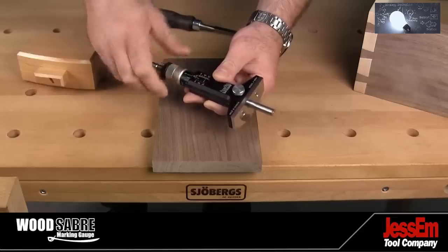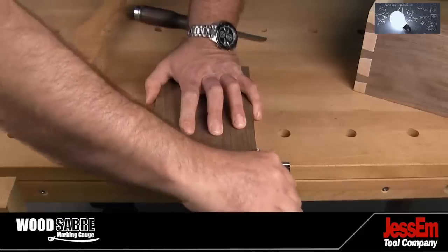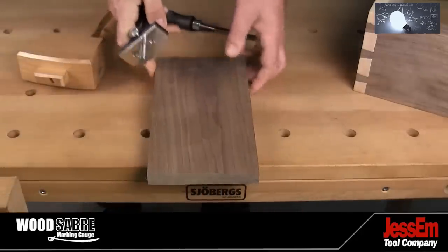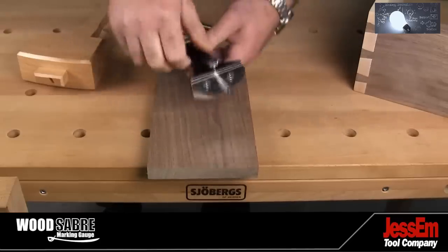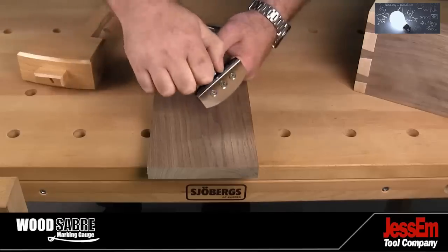We're adjusting the gauge now to cut a second line 5/8 of an inch away. The shaft was snapped into position in the next half-inch position, and the spindle was adjusted 1/8 of an inch. Two beautiful crisp lines spaced exactly 5/8 of an inch apart. When you're not using the gauge, the blade can be retracted below the face.